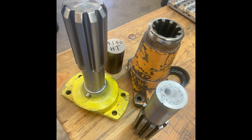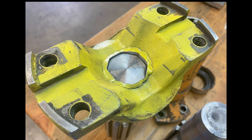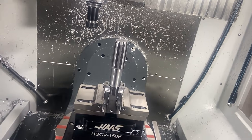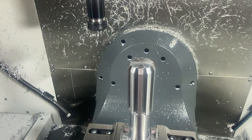Here's a spline shaft that broke — this is for a large machine that grades roads. We came up with an interface between the two parts and they ended up getting pressed together with a 50-ton press. Because of tooling reasons, we finished the spline on the UMC since it was going to be a little bit easier. Fun one there.